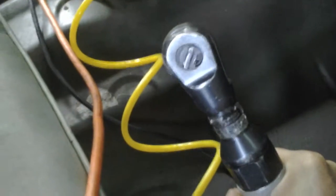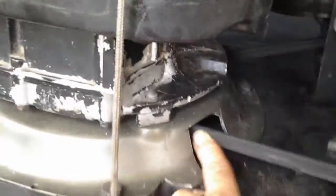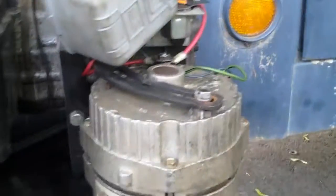We have this little inverter sitting here for demonstration. We have a grinder hooked up to power, and also a little air torque wrench hooked up. So from a lawnmower we have both power and air. What I did — as you can see — is take this Briggs and Stratton motor. The silver base is the hole that was in the lawnmower deck, and inside it had a pulley that ran the rear wheels. That pulley is now going to this alternator mounted upside down, and also to the air compressor.